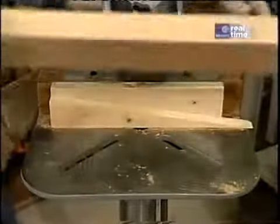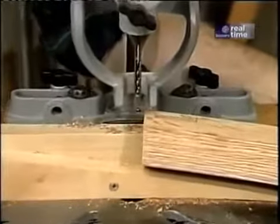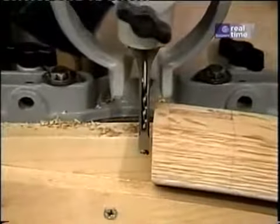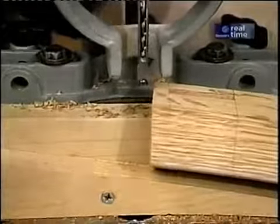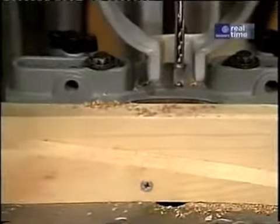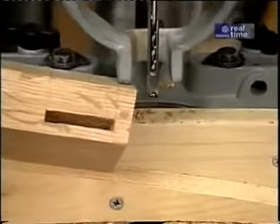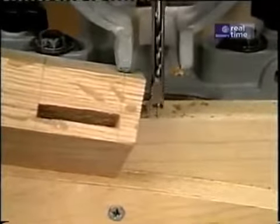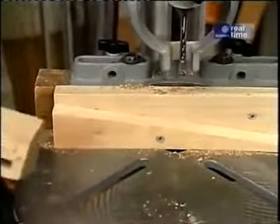With the first set of mortises cut, I've got to modify my setup a little bit. So when I made those first cuts, you could see that the drill will travel parallel to that top cut. Now if I simply turn the leg around on my 7.5 degree block and try to do the adjacent mortise, you can see it runs away rather than parallel. And I can correct that problem by simply reversing the 7.5 degree block.